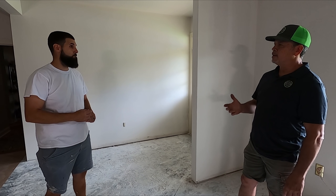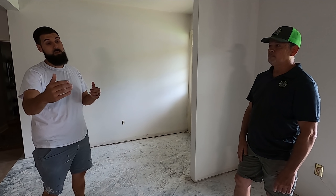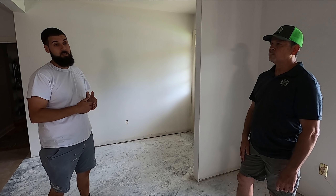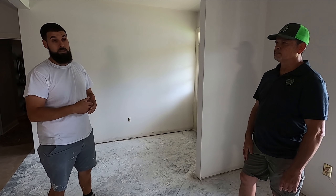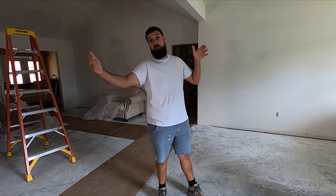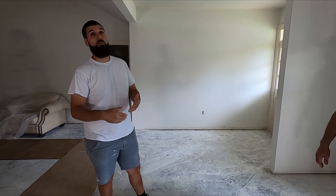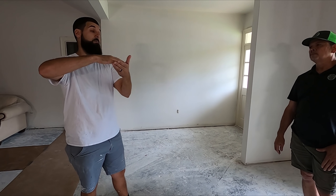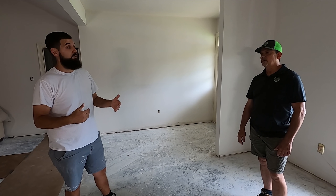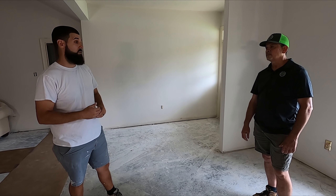What kind of mud did you use and how much? This takes quite a bit. If this house was completely new-hung, there wouldn't be a huge difference in the amount of mud for tape bed and skim coats, because we have stuff on the ceiling that's busted out nearly four feet wide to make it flat. You've got to get it flat enough so that when light passes over it, it doesn't have a hump and catch. If you put a straight edge on it it might not be flat, but what matters is the eye looking at it — if it's flat to the eye, flat to the hand, it's flat. If the hand can't feel it, the eye can't see it.